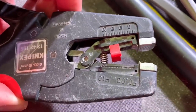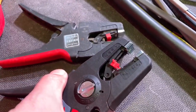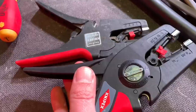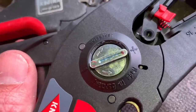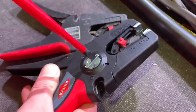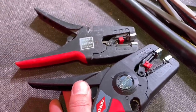You'll struggle to find 0.03mm cables, especially in most common electrical installations. So there's probably more use at that high end than at the low end. When stripping those fine-stranded cables — like the burglar alarm cable — there is a chance you could damage those conductors. That's where the fine adjustment comes in: you can bring in a screwdriver and turn this to slightly adjust the blades. If you've nicked a Cat5 cable and made it a bit weaker, it can be adjusted for that too — just fine-scale adjustments, and this wasn't available in the previous version.